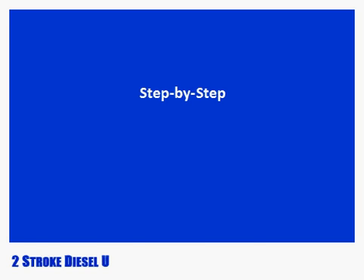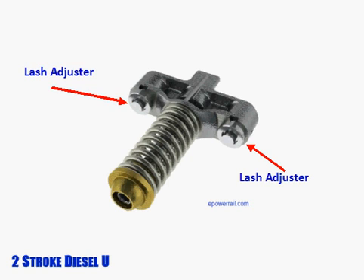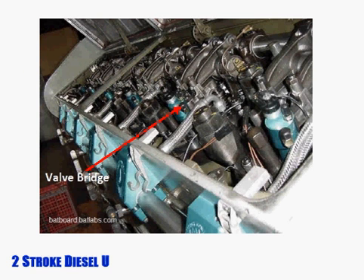A little EMD-specific background. As we've already seen, the valve bridge assembly consists of two lash adjusters, which are critical to the smooth opening and closing of the exhaust valve. While some users may replace just the lash adjusters, EMD offers complete pre-assembled and tested valve bridge assemblies with the lash adjusters inside. This is the more typical replacement method, so in this lesson we'll first walk through the procedure to replace the valve bridge assembly, and then the separate procedure to set the lash adjusters inside. Historically, the valve bridge assembly offered by EMD has been the same on the 567, 645, and 710 series engines, and there are two bridges required per cylinder.